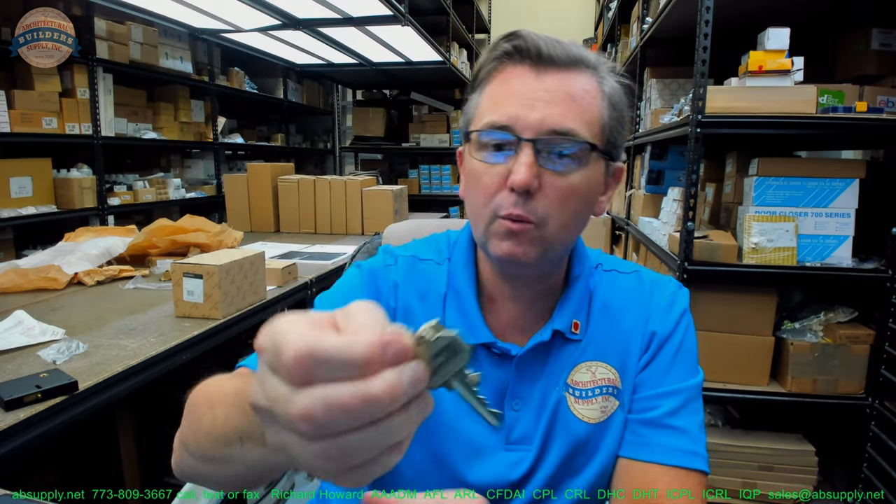Then there are the breakaway screws. Here are the pin tumbler keys — marked O3, which in Baldwin-speak means Schlage C keyway. Baldwin does other keyways by Schlage — I think they do a C, an E, and maybe an F or FG. I've almost never seen Baldwin in anything other than C. You could have a real hybrid of old and new — this nice rim lock on the inside of your door, and then run a high-security rim cylinder on the outside, like Abloy or Medeco.